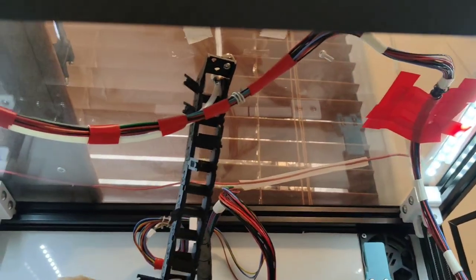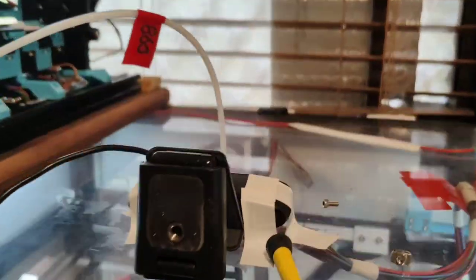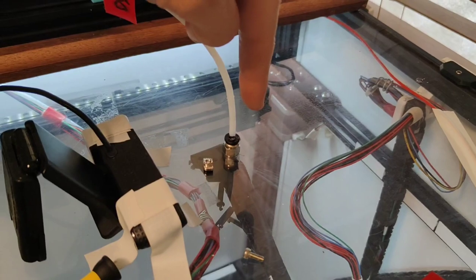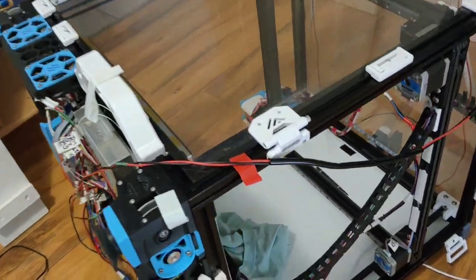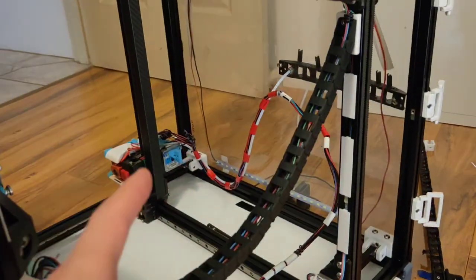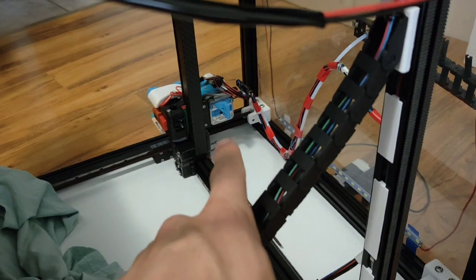Got my cable chain here bolted to the ceiling. That's going to connect up there so this chain can run through it. As you can see here, we're just using M3 screws with nuts. It's pretty messy. And if you wanted more height, you can just run your pipe through and run it on the roof. I couldn't handle it. I want the cable chains on the outside and all the tanglement, and I needed to shorten the cable. So this cable is going to be punched through here, coming around, so all these cables will go through, and it's going to disconnect at the tool head. I've moved this cable chain to the top, so the cables will come up here and go across the top. So let's get this disconnected from the tool head and wind them all back.